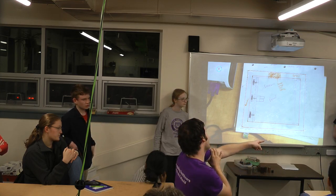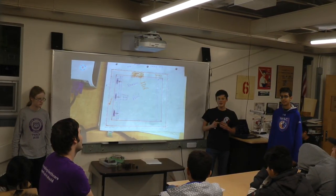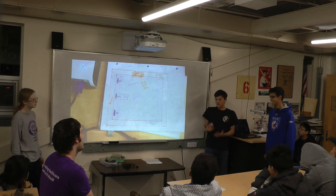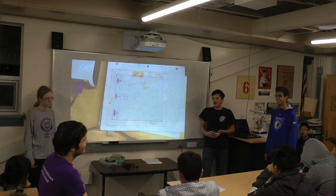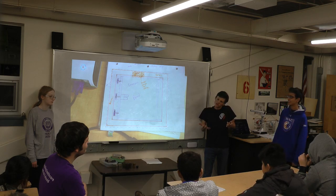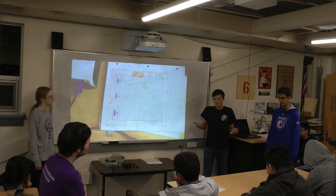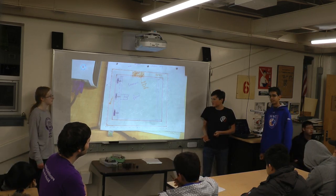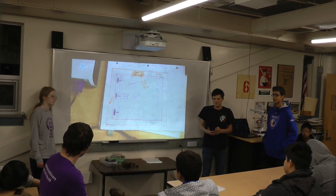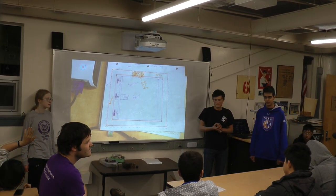So what's the floor intake on your chart there? Is it in the third column? We didn't put it on because originally the problem with the floor intake was we didn't think we could package it in our robot. And I still think it's going to be tough to package. It's going to bite into our hopper space because right now I have an inch between the edge of the hopper and the outside of the robot, which isn't enough to package an intake, even if it's completely vertical. So we need to cut into the hopper, and it might not be worth it. This is just an idea, and basically the reason we didn't want to do an intake is because we couldn't catch it. Other teams may find a way to do it. Our focus was hopper space.